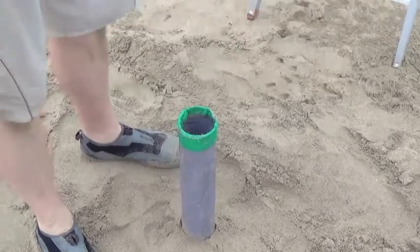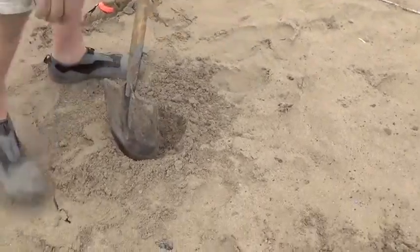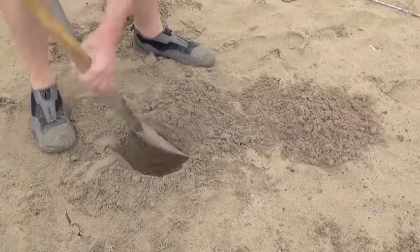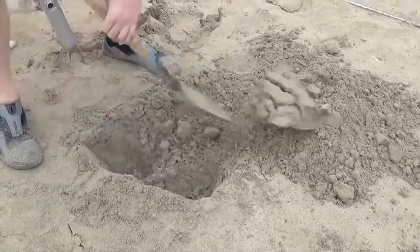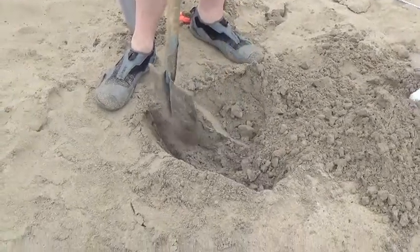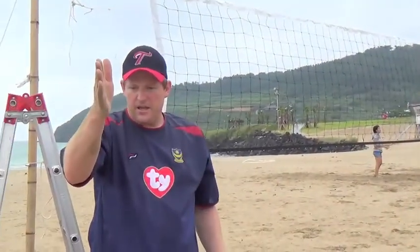Now let's dig the hole for the anchor. So we're going a meter back — about the length of a shovel — back here to do this hole. This hole has to be dug in such a way where you can come and hammer the spike into the ground. Basically you want this wall here to go straight down, but then you want to dig out here a little bit so I can swing the hammer and put that in there. And you have to eye it in, so make it a little bit wide because you don't know where the spike is going to go in, you don't know where the straight line is. I just like to make it a little wide just in case, because sometimes the bamboo poles they're not straight up and down. So sometimes your bamboo pole will go a little bit like this and you have to anchor it a little bit to the right to compensate and straighten it out. So I like to make this hole a little bit wide and make it in kind of like a quarter of a circle, so you have the wall there and then you come out so I can hammer down and through it.